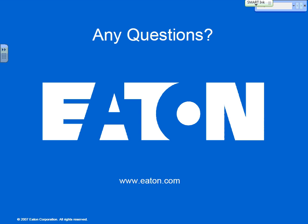And Todd can help you guys when you go work in the industry. I've been teaching for 10 years, and in the last 10 years, the students who graduated from here go work for Cutler-Hammer. They are stuck with a situation where they have to size a panel. We size for safety and also size for economy. We don't talk a lot here in the class about the economy of sizing, but Todd is going to be your friend on that and the safety too, because he can tell you instead of going to a 600 amp switchboard, we might get away with 400 amp if you adjust this and that. So you do a good job, guys, sizing for economy.